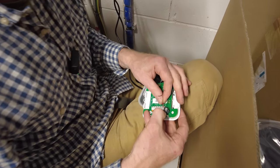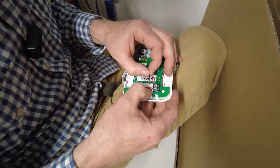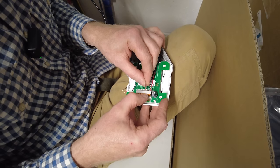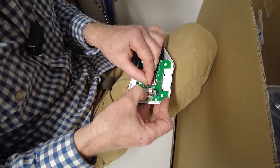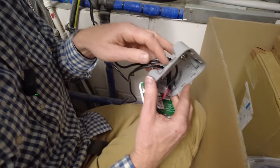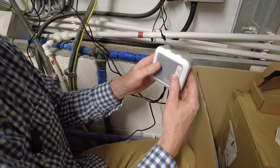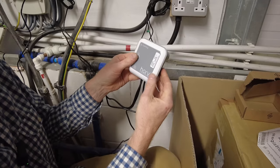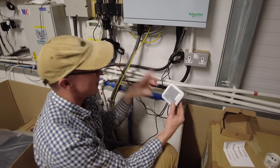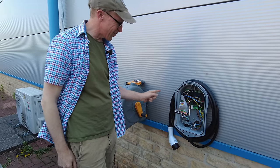I'm going to push the wire in - push down with my fingernail to open the spring connector, give it a little tug to check it's secure. That's as easy as that. CT2 - push down with your fingernail or alternatively a little screwdriver. You'll notice two holes on one side and two on the other. Snap it closed and we've got some flashing going on now. Bear in mind there's no battery in this and no mains power - it's just going to suck power out of the current transformer non-contactly. That's all ready to go.